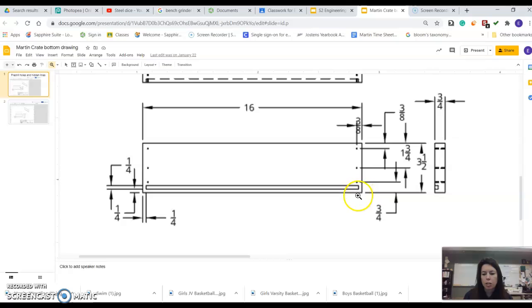And you will have pre-drill holes. There is one difference in these pre-drill holes. Your bottom pre-drill hole will be 3/4 of an inch up off of the bottom because of the groove. And it looks like when I did this particular drawing, I did fail to put the dimension of the diameter of the holes. They are 1/16 of an inch. I'll make sure when we do our drawing today in the example that I hopefully put that in there.